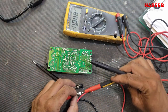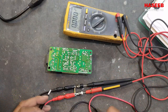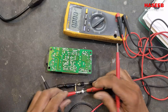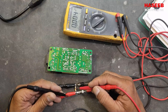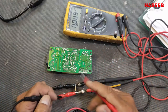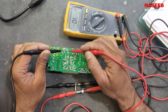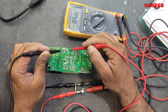If we use our capacitor discharge circuit, it is very simple — we can encase it in a small box with two test sockets. These test sockets are available very easily and cheaply. We just need one test lead probe set and a 100 kilo ohm, 1 watt resistor, encase it in a box, run the leads out one side and connect the test sockets on the other side. Now we can see the capacitor is discharging quickly.